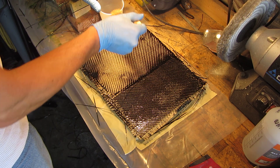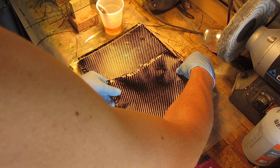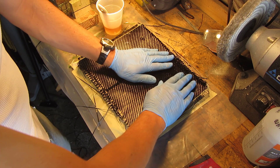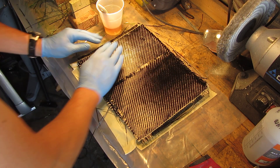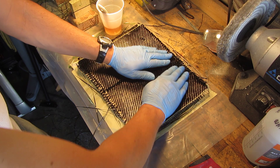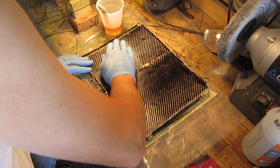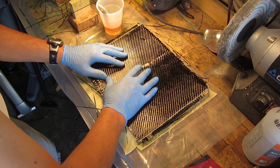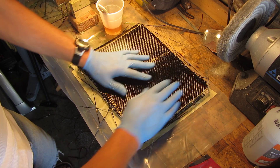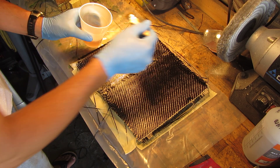The important part is as you work through each layer of carbon fiber, don't forget that each layer of carbon fiber goes down and another layer of epoxy goes down. You can see — I don't know if the camera is picking it up — but you can see that it actually is saturating. You can see the satin sheen to it when you have pushed enough of the resin through. You need to take great care not to disturb the layup because if you do, you're defeating the purpose of making a strong layup.